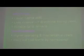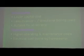Again, there are advantages and disadvantages to this as well. It's much lower cost than a gravity system, particularly if you're not planning on rejuvenating the road. If you do so, we found out from South Huron that the costs are very comparable between the two systems, and that's where most of the money goes. That is the difference between the two. It is less invasive because they use directional boring to put in the small diameter pipe.